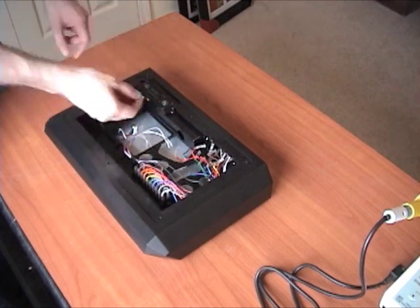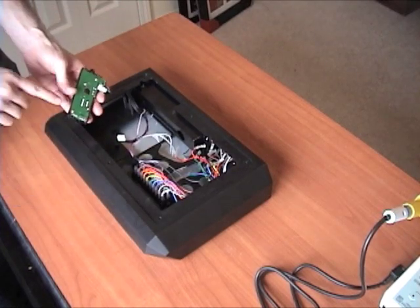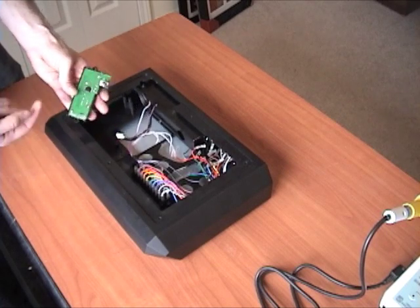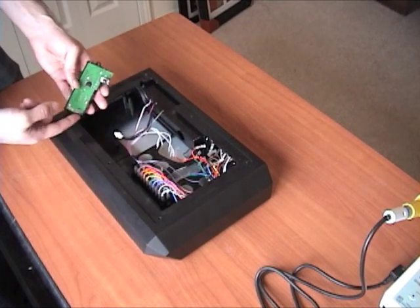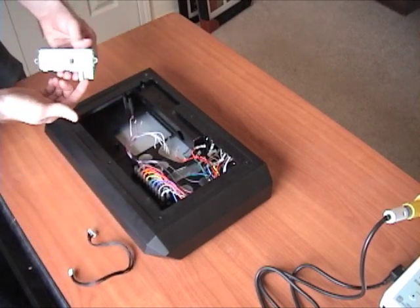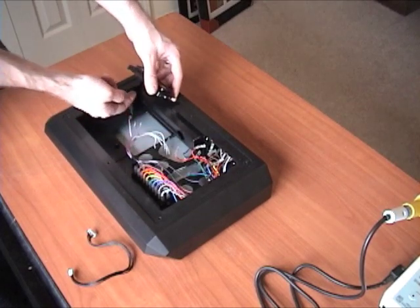Then there'll be two screws to remove here — I've also removed those so I'm just going to pull this out. Like I said, you'll have the ribbon cable so you can make a decision: you can do what I did and cut them right at the bottom if you're never going to use them again, or if you think you might one day hook it back up, snip them a little longer so you can easily reconnect. At this point I had to desolder all of these out, clean that up, and then re-solder the ends back in. You'll also want to remove this joystick cable. Another thing missing from mine is the USB cable — if you want to keep it, make it longer; if not, snip it close like I did.